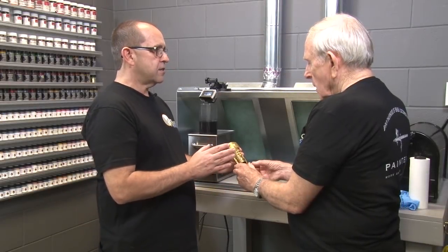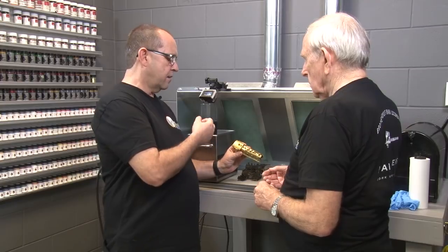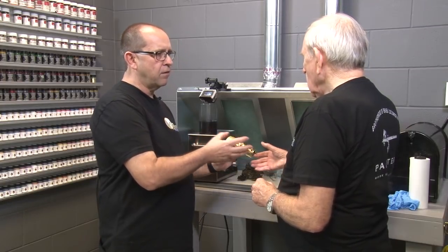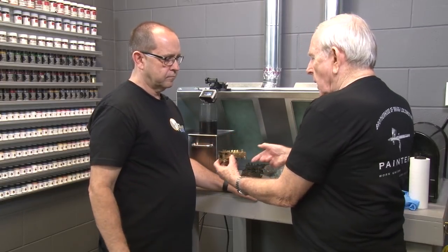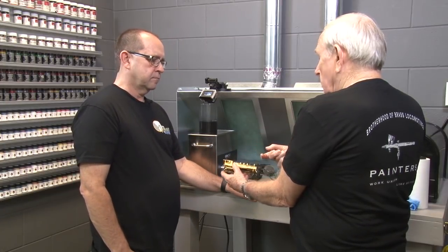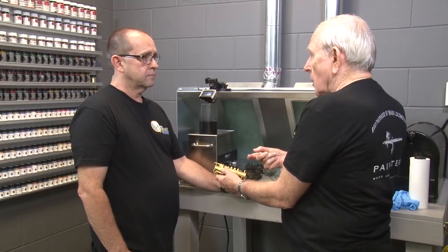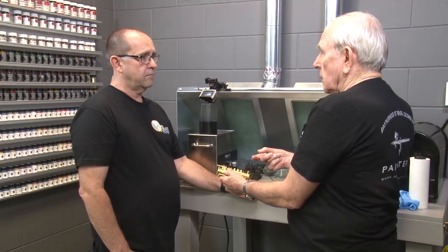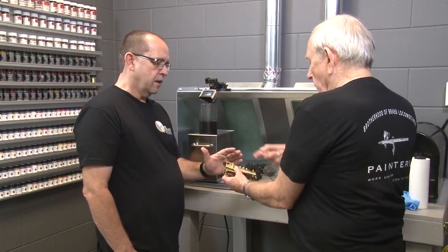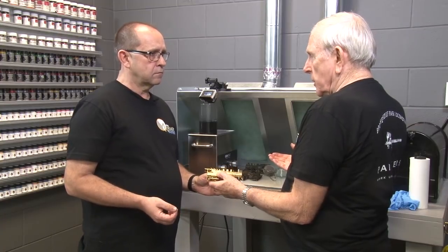So now, can I ask you, when you spray the aluminum oxide, you're not staying in one spot, you're doing a really fine coat? I go at a shallow angle. If you sit there with 280 grit, 250 grit aluminum oxide, you can remove rivet detail. So we don't want to do that. I just go down it, and I'm spraying at 80 psi. I've never warped a brass engine with aluminum oxide.